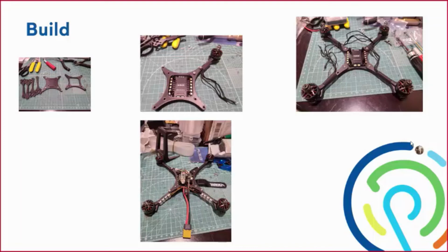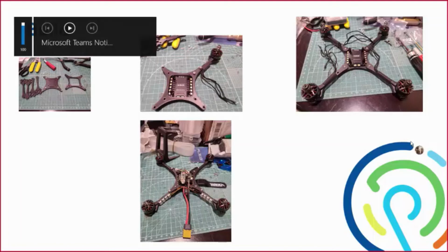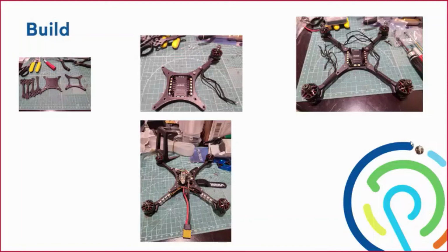And as I didn't say before, we had one revision which we made to the bottom plate, and that was to add in the little insert holes or relief holes for those inserts. That way they fit flush instead of having a larger lock nut that would stick out and act as a snag point when we're flying the quad, if it ever got snagged on anything. So it's lower profile, and works the same way.